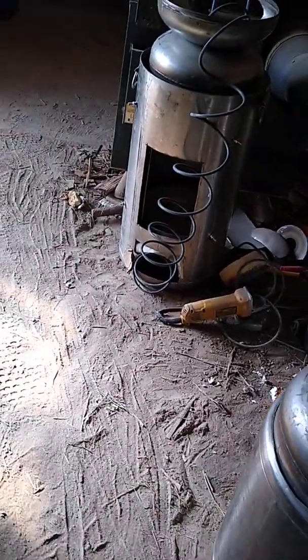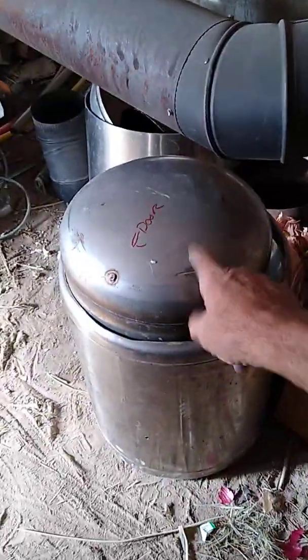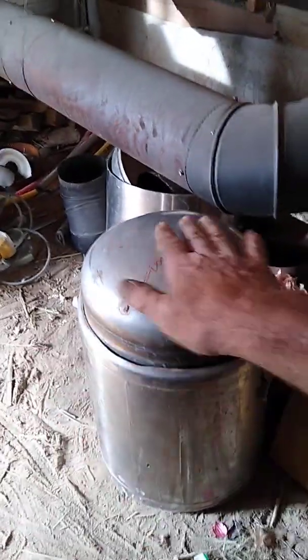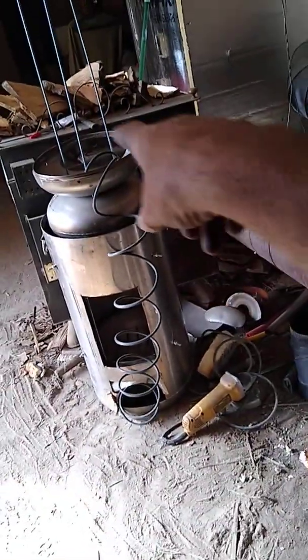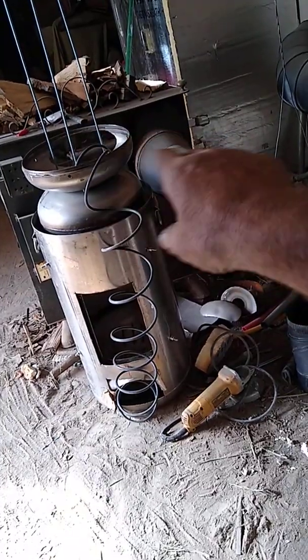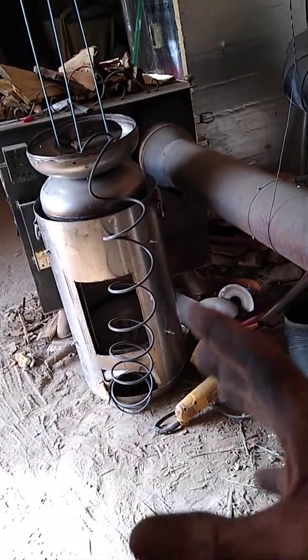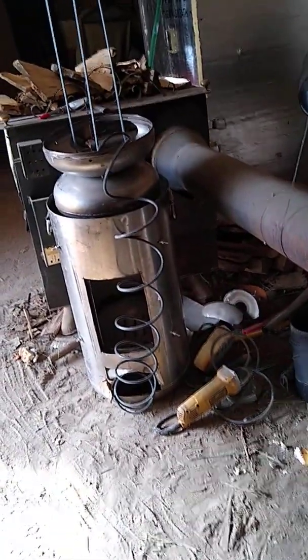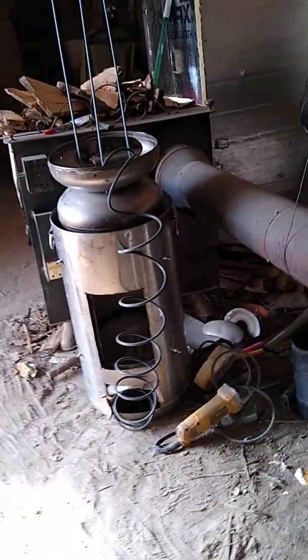The device here is I'll use the upper canister to wrap the coil for the two coils that'll go inside. This coil will be the first one — I already took it out — but the exhaust is that oval in the back, and it'll be the first one down on that pipe to take out all the heat. That'll still be in the thermal mass section of the stove, actually in contact with masonry.